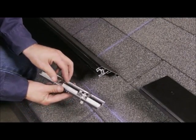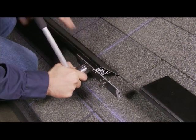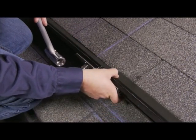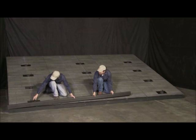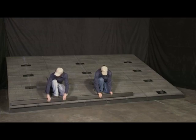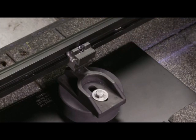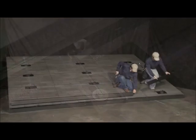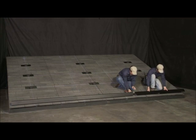After securing the front row leveling feet, an interlock with a spacer is used to couple the first two sections of the skirt jig together. With a spacer between the interlock and the skirt jigs, the interlock is inserted by hand into the ZEP groove at a 15 degree angle. With the use of the ZEP tool, each ZEP is turned from position 1 to position 3 as indicated by the timing marks on the ZEP tool relative to the timing mark on the interlock. The coupled skirt jigs are then installed on the key side of the front row leveling feet. The installer will feel the skirt jig snugly rotate onto the keys. To prevent the skirt jigs from unintentionally coming free during the installation, a jam is inserted into each front row leveling foot. The remaining sections of skirt jig are then snapped onto the front row leveling feet using interlocks, spacers, and jams to couple and secure as before.